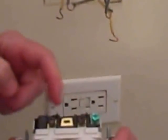A switch is just a break in the hot — there's no neutral wire connected. We just have a hot coming into the switch and then the hot leaving the switch to turn on and off a light or a fan. When it's two switches in one body, they mark the top terminals with a darker colored screw and we've got gold on the bottom. Normally you'll have one hot coming in that you can attach to either screw and it sends power to both switches. We're going to make sure the off and on lettering is correct — that shows the top of the switch — and connect the wire from the breaker box to the top terminals, then connect the wires going to the light and fan to the bottom.